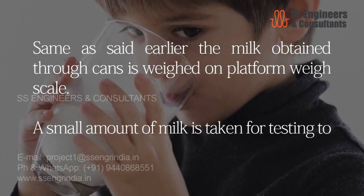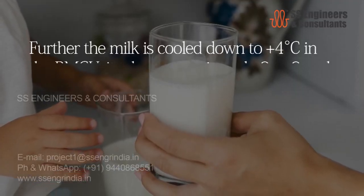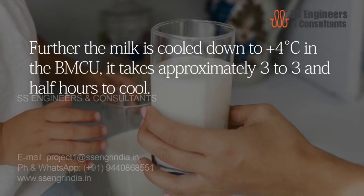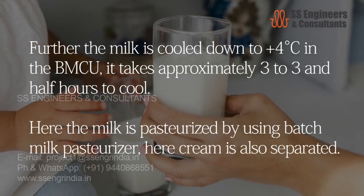A small amount of milk is taken for testing to check the percentage of fat and SNF. Further, the milk is cooled down to +4 degrees Celsius in the bulk milk cooling unit. It takes approximately 3 to 3.5 hours to cool. Here the milk is pasteurized by using batch milk pasteurizer.